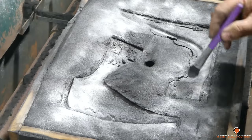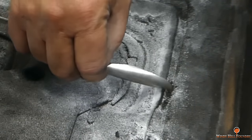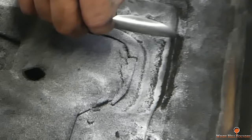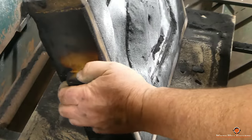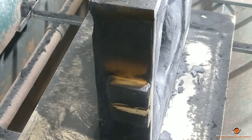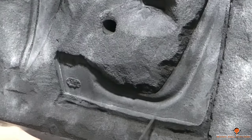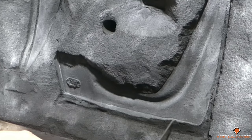The iron, which I do most of the time, as long as you use a consistent melt point, a consistent melting time, the inoculant timing, along with the inoculant weight, the waiting, you know, 24 hours before you pull the mold, along with the stress relief time, there is no need for me to worry about it, because all the material that I'm putting in that furnace on that first generation melt is accurately monitored by the foundries that make these rotors. As I have said before, they go by a very strict standard all across the automotive industry on the composition of the rotors. Regardless of whether it's some of the alloy that I need or not, they always come out consistent, and the end result I've never had complaints with. If there's any chill in these castings, it's strictly from the pattern design, not my process.